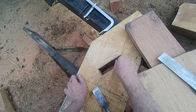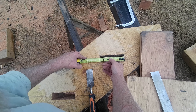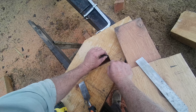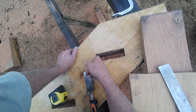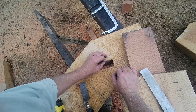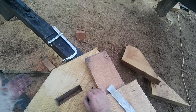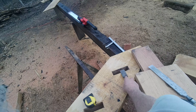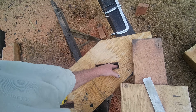We're still going to round this off and show you how the tab works, but we just want to make sure everything's going to fit snugly. On the outside here, we're having the six-inch tabs, but I'm just short here. On the outside, we mortised it short so I can chisel it in perfect to fit tight — we didn't want a big wide open gap. It's a little bit more hand work, but the result comes out great. This is the most important piece that everybody's going to see. The whole other side will get routed in and any little imperfection there will be hidden. But right there, people are going to see it forever, so I'm going to spend a little extra time and get it done right.